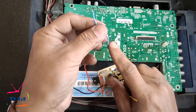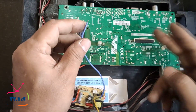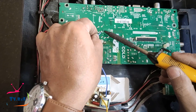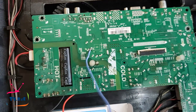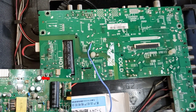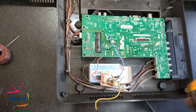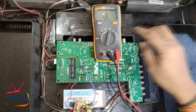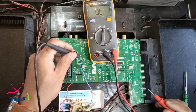The blue wire is connected where the negative supply is available on the secondary side of the power supply. The negative and positive terminals of the 12-volt filter capacitor are connected on the secondary side of the power supply, because the power supply's main output voltage is there. From there, the feedback voltage is given to this module so that it can keep the power supply's output voltage stable.